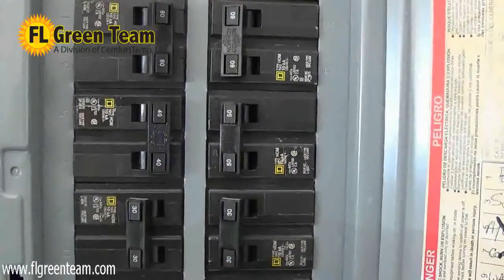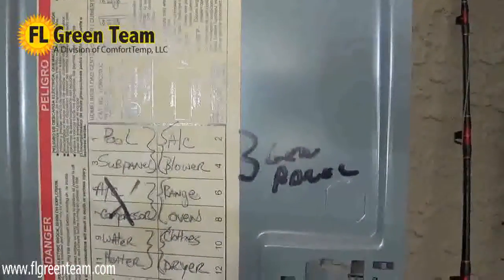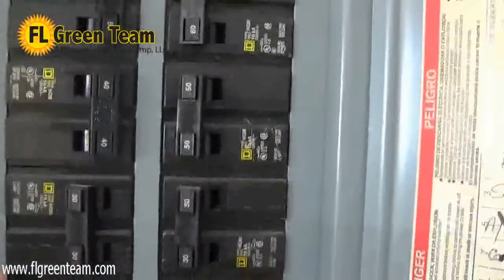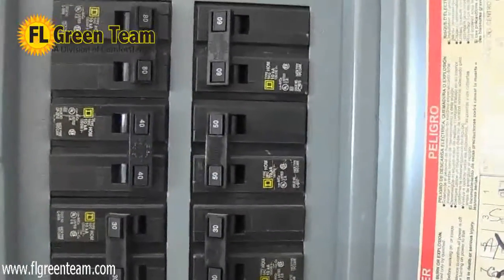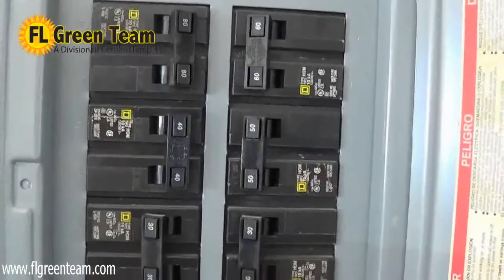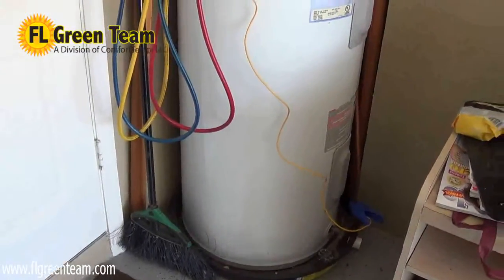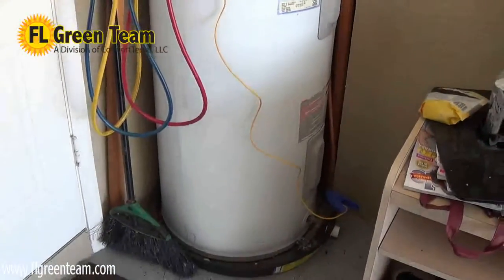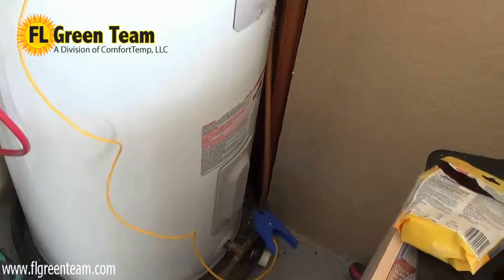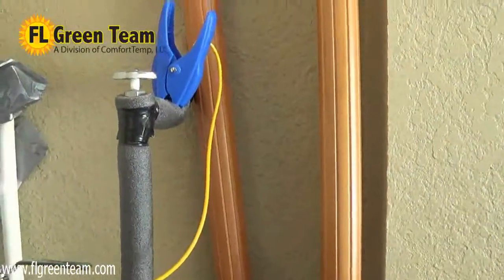Something else we wanted to point out: in Mr. Villaverde's house, as you can see at the breaker panel, it's completely off. The third breaker — labeled for the water heater — is completely turned off. So he is getting five occupants benefiting from free hot water just by running the air conditioner. Here at the water heater tank, the clamp on the bottom shows the hot water returned from the heat recovery, and over here is the cold water leaving the tank going to the heat exchanger to be heated.